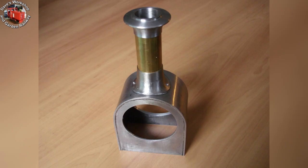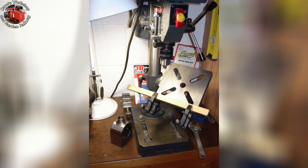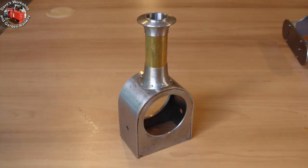A couple of years ago I ordered some 10BA hex head screws from Mac Models. When they arrived I found they had smaller heads — I always use standard head screws, so I put them away. These screws are perfect for this job; they have 12BA heads or 2.5mm AF. Here we are with two screws fitted — the size is okay. Here is my drilling setup for the base holes. I held the smokebox base to the table and timber backstop; the holes were marked out and center-punched first. All eight holes have now been drilled and tapped. The next stage will be to mount the smokebox to the loco frames so that the cylinders or boiler can be started, and then the smokebox can be completed.